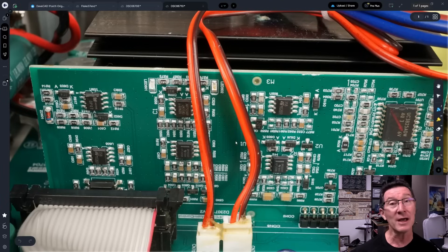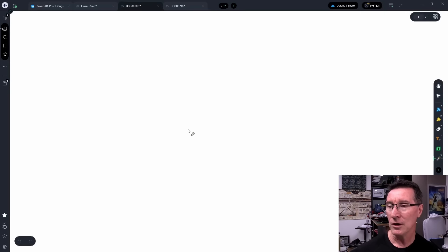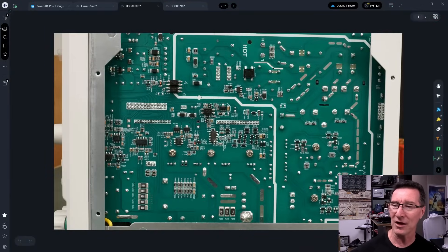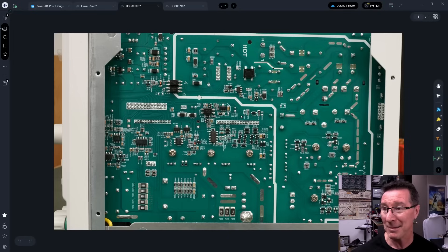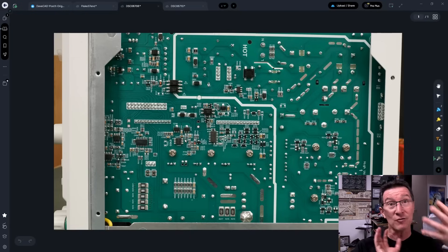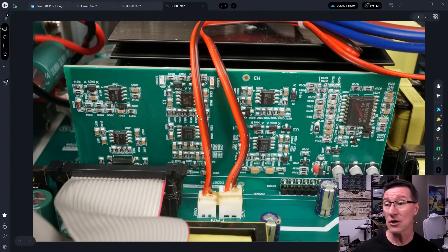Let's take a look at the board inside in question. This is the controller board inside, just on its own board here — a vertical riser board. There are several reasons why you might do that. The main board is just one big thing, and the bottom side has all the SMD components. The through-hole side on the other side has all the big through-hole components — the big pass transistors, heat sinks, big capacitors and everything else. So trying to cram all the control circuitry on the bottom side with this double-sided load is not the best idea. You'll find this very common inside switch mode power supplies, lab supplies like this one, or commercial grade ones.